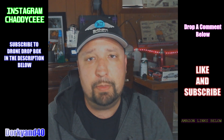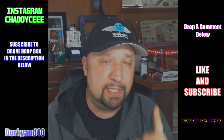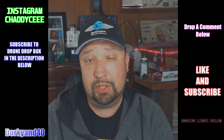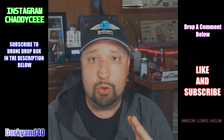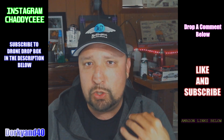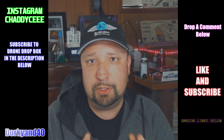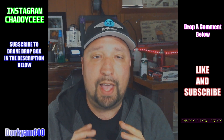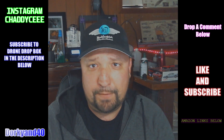I'm going to share all this with you — it's changed a lot since the last video, especially with flipping the D's around. I advise everybody to try it with caution: make sure you have a handle on the noise going on inside your build. It all starts with filtering — get your filtering and noise profile under control so you can raise those PIDs and get the feel you want.